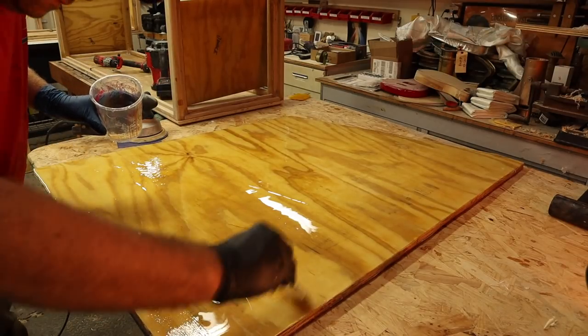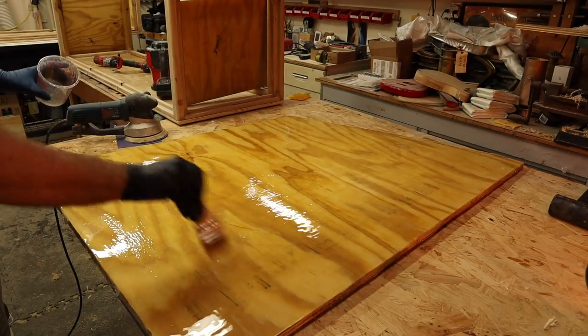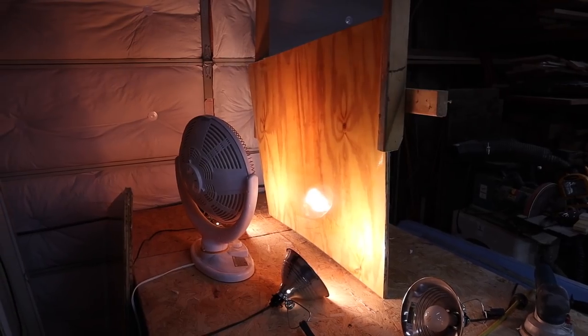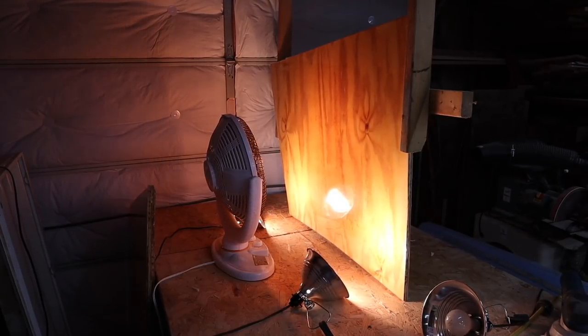We didn't have that warm summer sun to complete the post-cure heating process that's required of this special resin-rich epoxy mixture we're using for the diesel tanks, so we needed to use artificial means to get that temperature above 120 degrees.